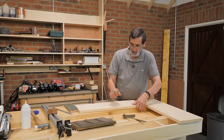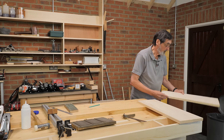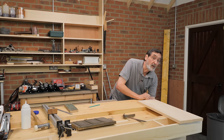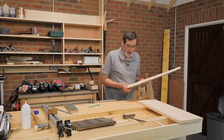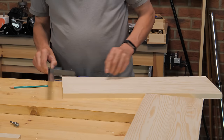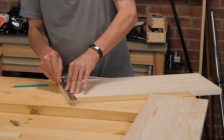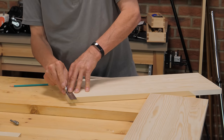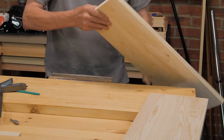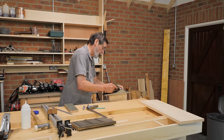I'm going to mark the next one now. This one I haven't squared the end up — I don't know which end is going where, so I have to make some choices. This goes under here and I've got a gap at the far end, so I may not be square. There's a gap at that end as well, so I'm going to square this end up and trim off that little bit with the plane.